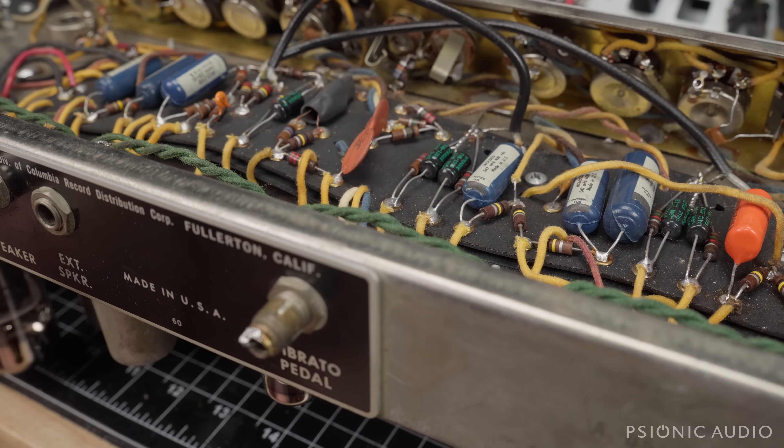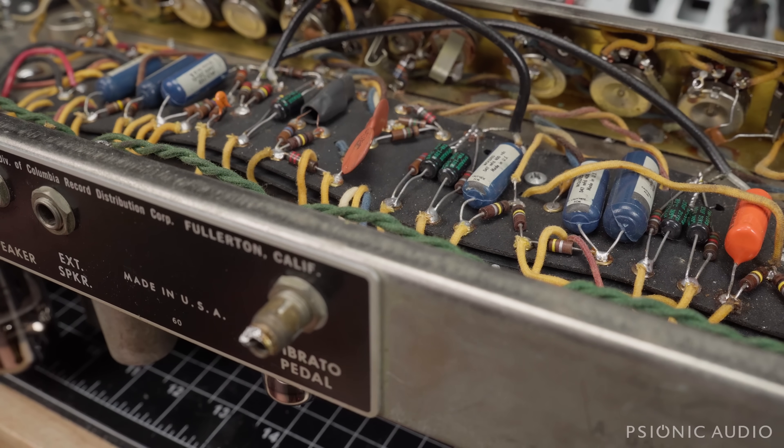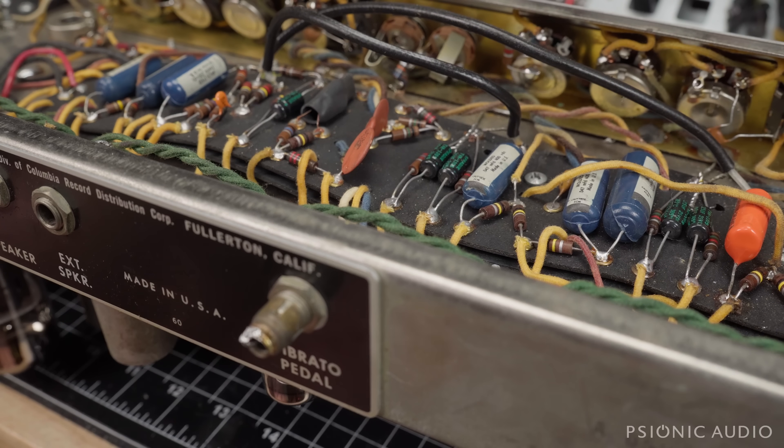So it's a good amp. It's not in pristine condition, but it's in very good shape. I'll let the buyer and the seller sort out what the price should be versus the price that was paid. Personally, I hope the buyer gets a partial refund from the store and everyone walks away understanding what's going on. The buyer could, if he becomes the long-term owner, have a fantastic amp on his hands. It definitely needs the power cable correctly installed, may need some board cleaning, and some old tubes might be causing static. I'd like to clean this up and put it back to how it would have been in '65-'66 — but overall, this is far from a harsh critique.